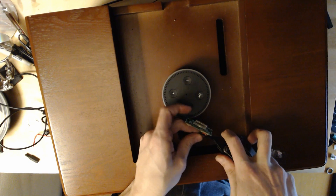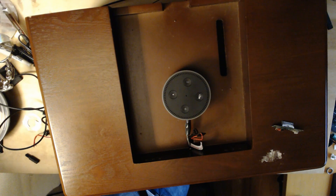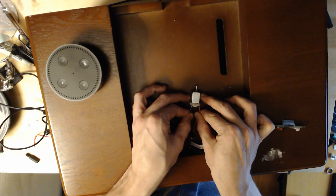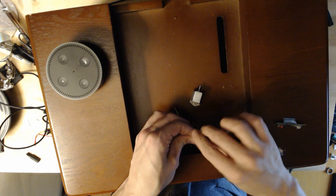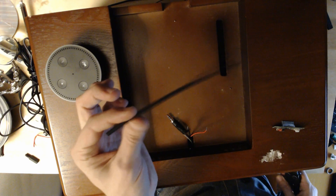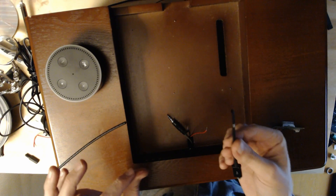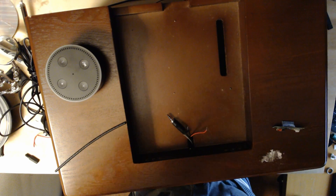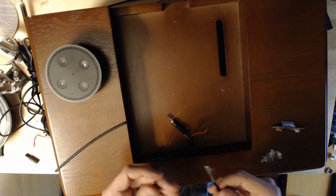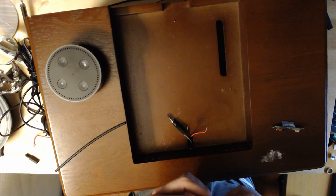Now that I had that done, I needed to free the cables — free the display cables, which I just kind of hid in the box — and then free the power cables. When you're touching or messing with any power, even if it's low power, unplug everything. I stripped everything and then tested them with a motor — not the smartest thing to do, but I wanted to see because we had two reds and two blacks whether any of them were higher voltage. Higher voltage means higher speed on the motor. Both seemed to be going at the same speed. So once I confirmed the red wires and ground wires were good, I took two of them and capped them off safely. Then I had the red wire and the black wire, which I kept available — those were the ones I was going to use for my USB.